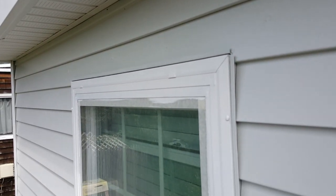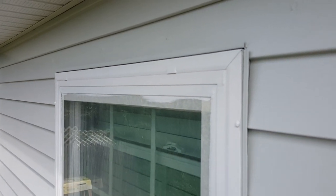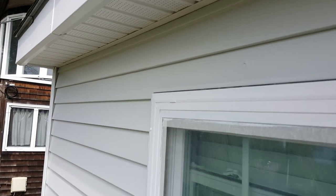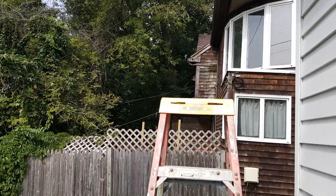I sprayed the body here. And like I mentioned in my other video, I used a 208 tip, which is the finest airless tip that we can get without having to go into the HVLP, which is high volume, low pressure spraying system. Alrighty. Okay, bear with me.